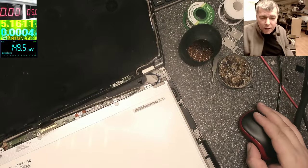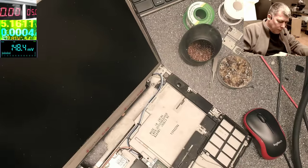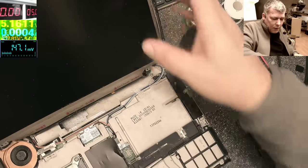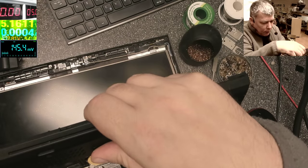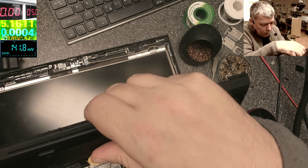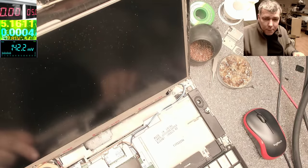I didn't know the keyboard was gone till now. So we took out the bridge. Let's plug the charger and let's power up the laptop without the keyboard. How we can do that is resetting the BIOS and the laptop comes on by itself, yeah? The BIOS battery is out. Plug the BIOS battery back. It's on, the fan is spinning.